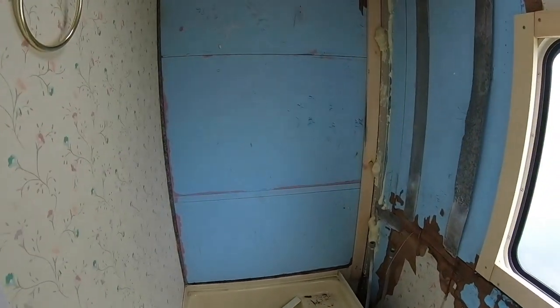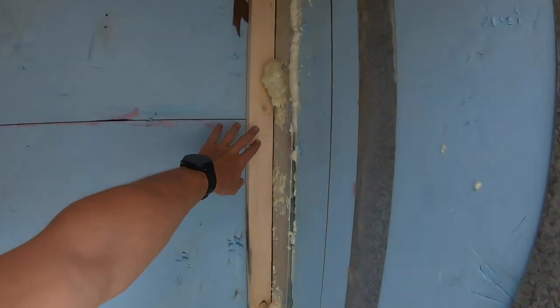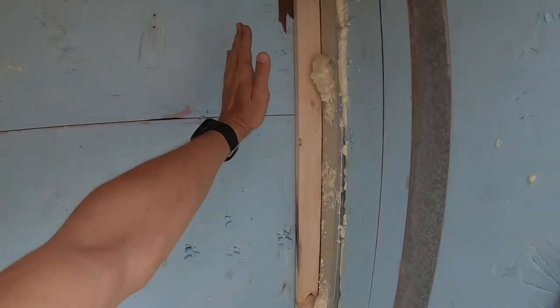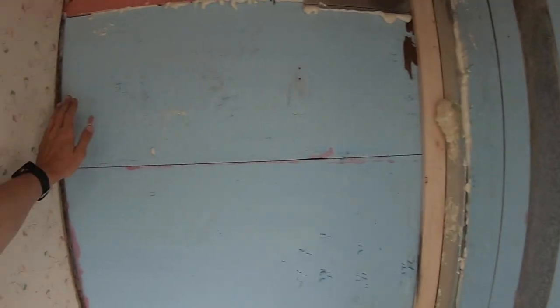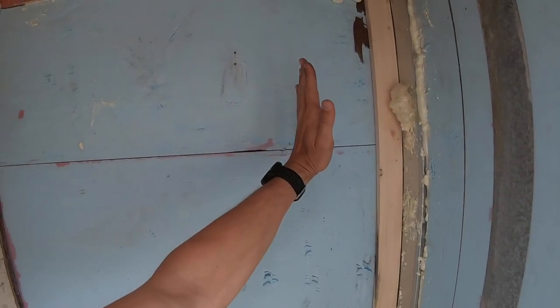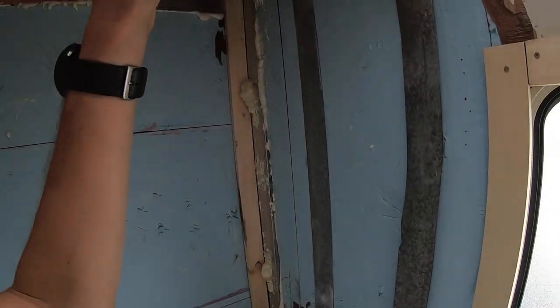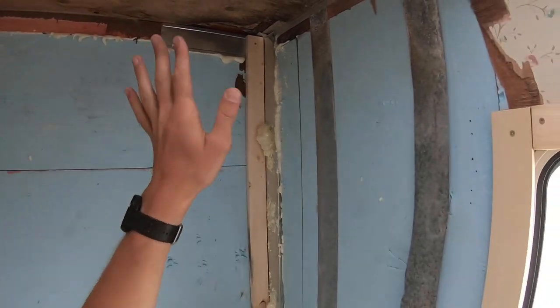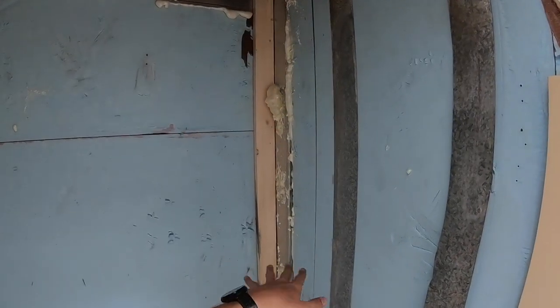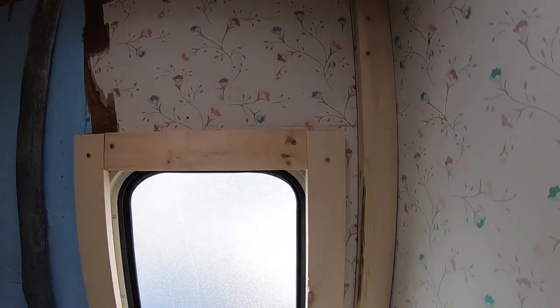We're going to be doing like a corrugated iron finish, so this line and this line on the walls, and putting these up. We're going to put some more a little bit further across, build a little bit of a false wall box for the shower head to come out, and then the corrugated iron will, because it can bend, it's quite a good material, you can go across and then bend it at 90 degrees and then bend it at 90 degrees again, and it just means that all that will be boarded up. We'll probably do plywood or something, just board it up to keep the vapor barrier stuck down. But it will mean that it's all hidden in behind there, so that all you see is the shower head and maybe the taps and that sort of stuff. And we'll use the existing bath because it's a good enough unit. At the moment, it looks like a bit of a mess, but work in progress.